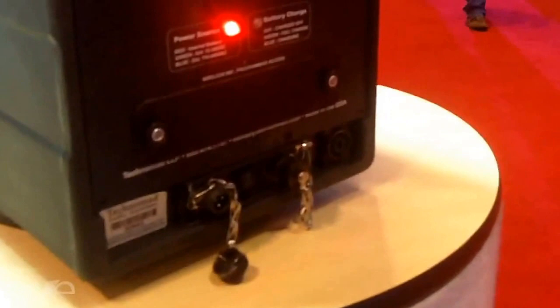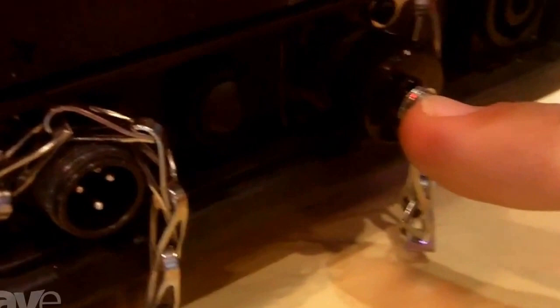An integral wireless microphone comes with that standard. Multiple power inputs — you can see here at the bottom — for 110 to 220 AC input or 12 to 24 volt DC input. It's got a four to five hour full power operation internal nickel metal hydride battery, which has huge advantages compared to lead acid in terms of very lightweight and performance.